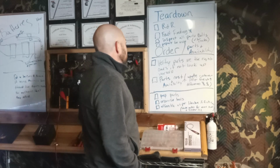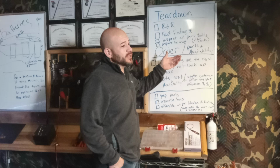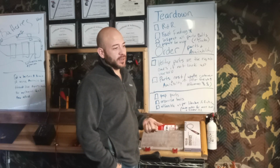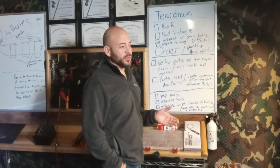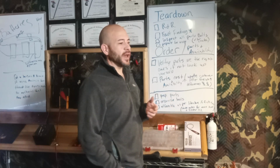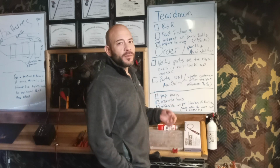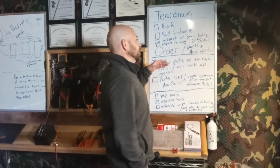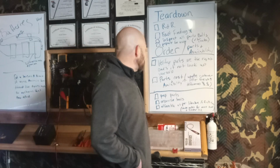As far as preparing them for assembly, a head is a good example. Let's say you had a head gasket that was leaking and you chose not to send the head off. That's your choice and you're going to have to deal with the repercussions, but at least inspect the thing. Get a magnifying glass, do what has to be done to inspect it. It's good because after you do it, they're going to blame you. Once the head comes off and you are the one who put it on, it's your fault. I don't care what happened. You should have told them you needed parts if you needed parts. And if you didn't, make sure you write it in your story so that you can cover yourself.